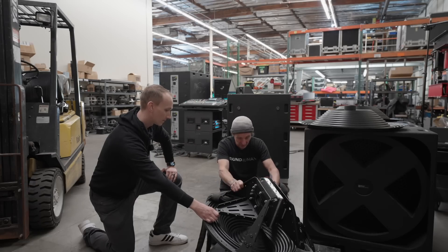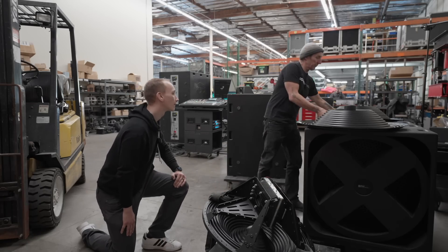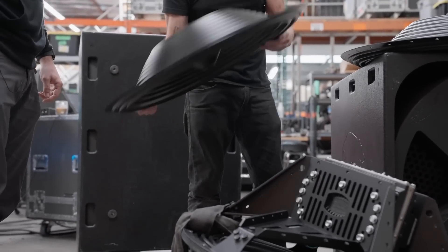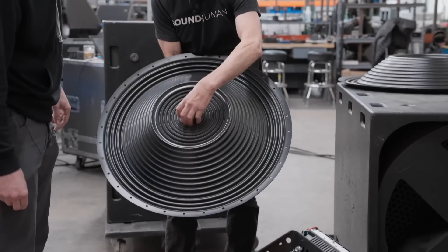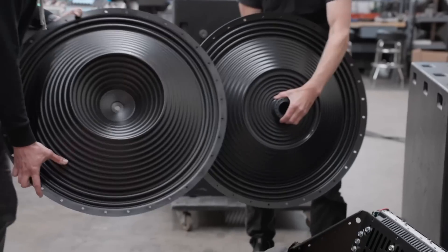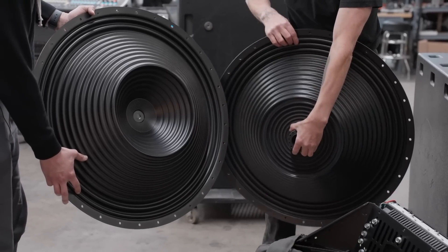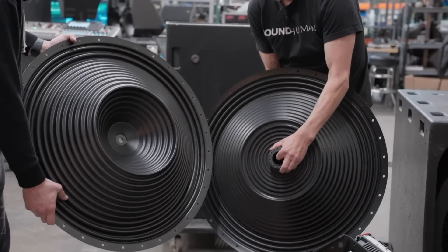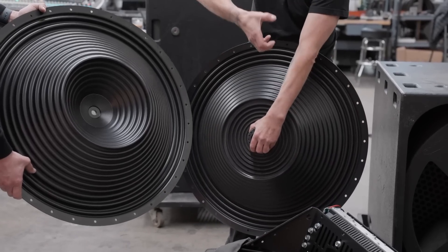So these are what's in the super stuff. What I'm doing is modifying these — I'm adding this bottom frame on here, which has another spider on it. Here are the old cones, attached here with a standard cone with a bolt in the middle. What I'm doing is upgrading them to these that have the same attachment point, but also a secondary spider mounted here that gives it more alignment. What was happening with these ones is when being driven hard, one side was getting hotter than the other, becoming softer, and the cone was rocking. That was putting stress on the motor and cone and causing premature failure. Now with this second spider, it can't move side to side — it forces it to stay aligned onto that motor shaft.